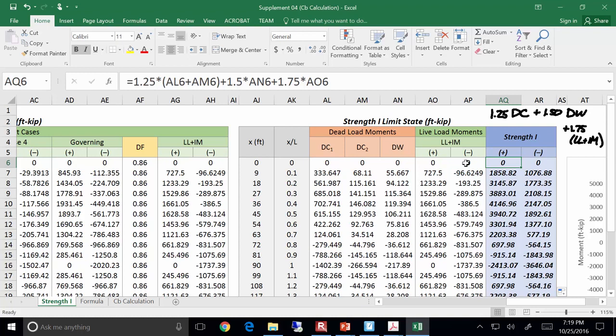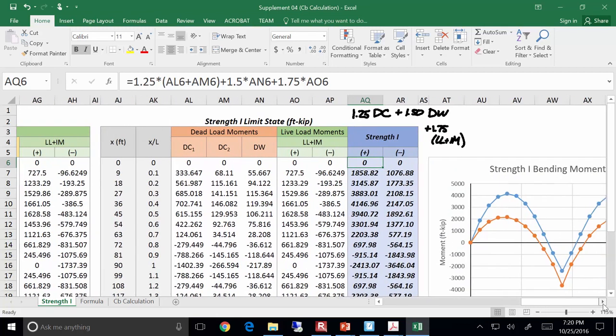I'm not dealing in stresses, because you're going to see here in a second that for this girder, Appendix A governs. And if you're in design mode, you want to be designing with Appendix A. Okay, you're going to squeak out more capacity. Sound good? Now, if I plot those moments, it's going to look something about like this.